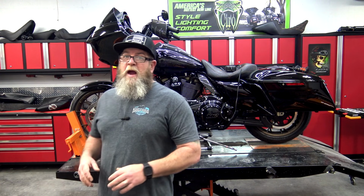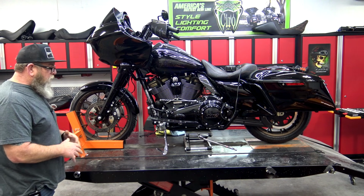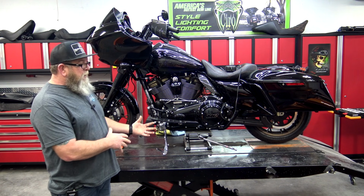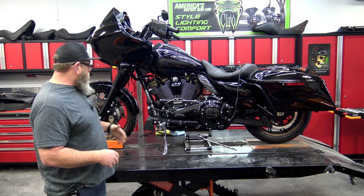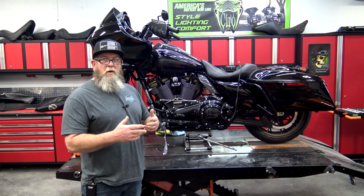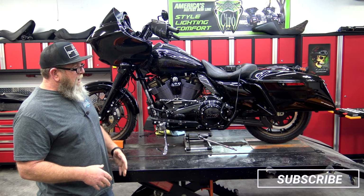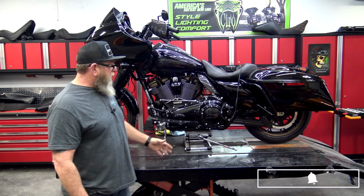I've scooted the camera back just a little bit so you can see the whole lift. I want to talk about this lift in particular that we have. It's the 1500 pound XL. Now with the XL package, I think it's $200 more, but you get the side skirts, and I do believe you get the chopper extension for the front, and that's over $200. So if you just get the XL package, you'll save a little bit of money there. This is an air lift. You have to have a compressor that pushes at least 90 PSI to use the lift properly.